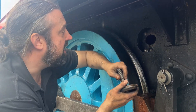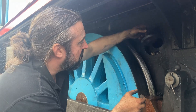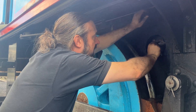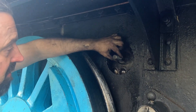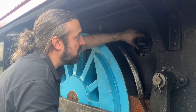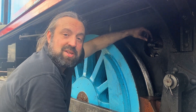These things are a bit of an awkward design. You can see it doesn't look like it's going to fit, but if you very, very carefully wiggle it through — there's a gasket that goes on there, of course, that I haven't fitted — but then you have a little bridge section which goes over the top and a nut which keeps it together. It's actually the pressure inside the boiler which keeps the joint secure. Mud holes and wash outs.